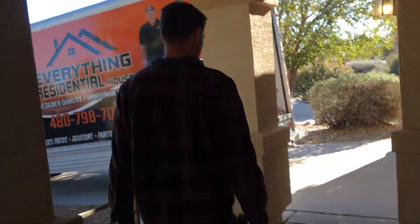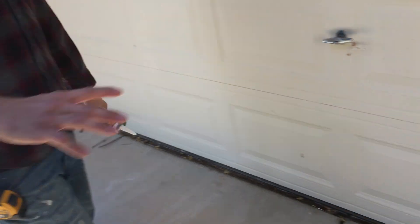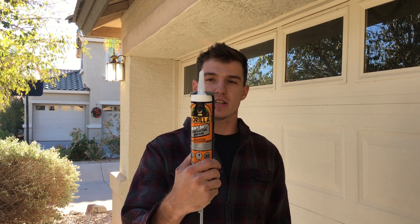Once again, you need to go outside and find the stamp. When the concrete is wet, they'll put an imprint into it so it hardens with the mark — it's going to be right in your garage area or on your driveway. If there is a stamp, you do not want to drill into your concrete and hit one of those tensioned wires inside the slab. Verify first, and if it is post-tensioned, use a good construction adhesive and glue your sole plate down to the ground.